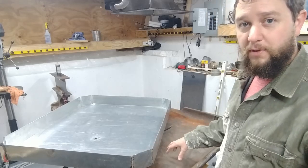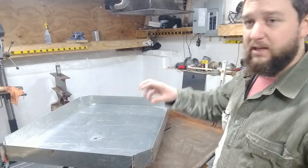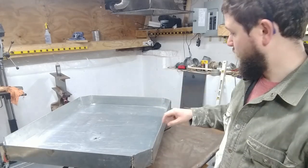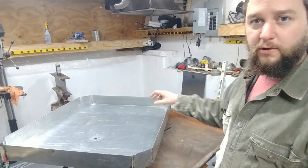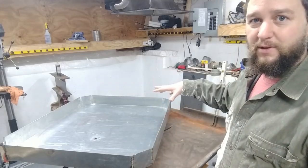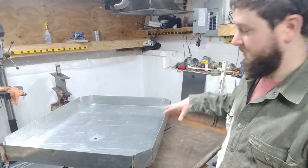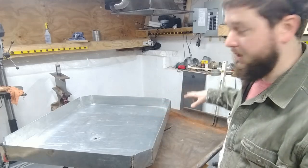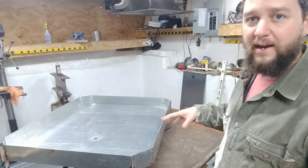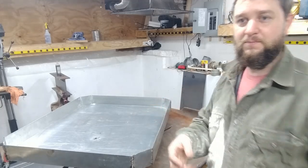First, I'm going to put this in position, because obviously the floor is not perfectly level. And I'm going to shim down using a planer, just a couple pieces of wood, so that I can put markers in here. And then once I have it in place, I can clamp this down so it's fairly secure against those shims, but not too tight. And then foam all the way around the sides between this plastic sheet to create that kind of bed for it to sit in so it's perfectly level.